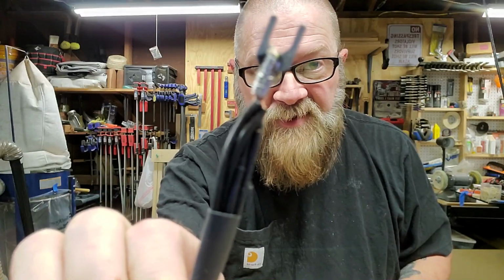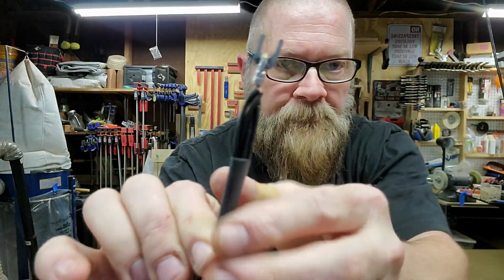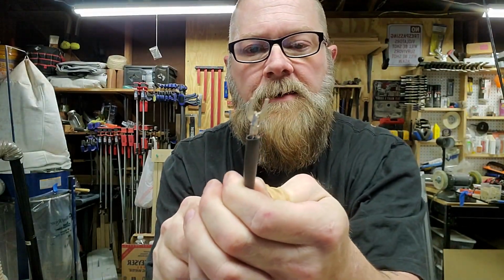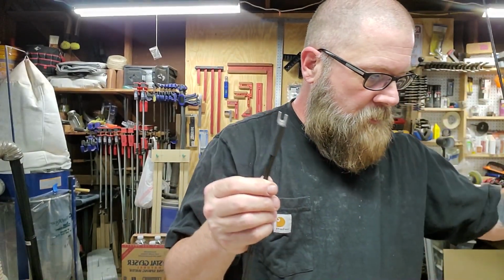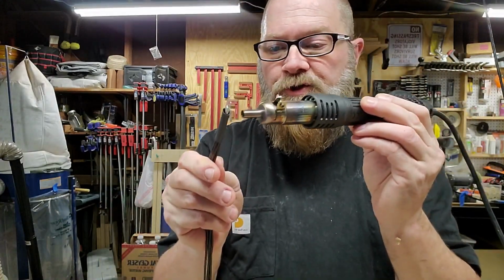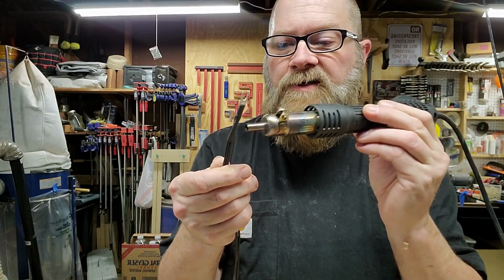Okay, I just want to give you a little bit of progress here. Now that we have crimped and soldered everything, we'll just slide the shrink tubing up as far as we can. All right, so now we get the little solder reworking thing here. We'll get this all shrunk down. Make it look nice and neat.